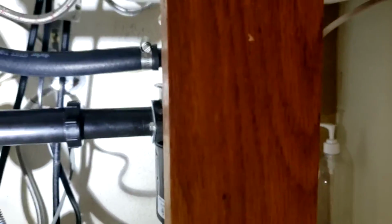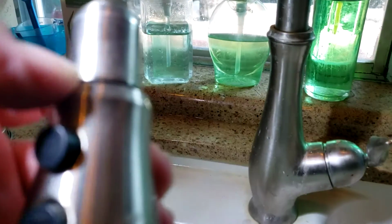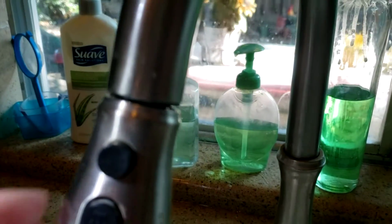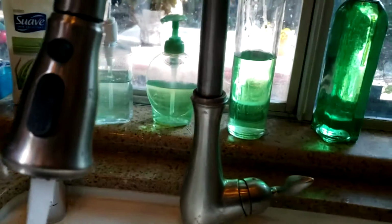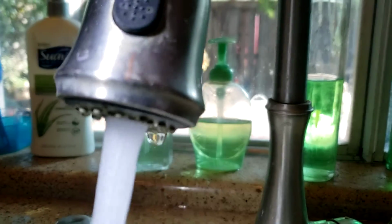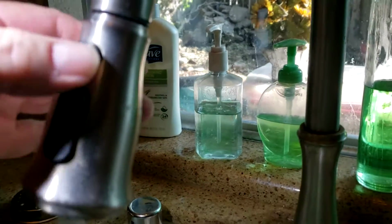So the other issue was the faucet was slow functioning, so we just pulled this hose out right here, disconnected the spray head, and cleaned out a little rubber gasket screen that's in here. So it flows pretty good. This thing doesn't really stay fitted real correctly, but right now I think that's infinitely better than what you had. A lot of that functionality still is the clogged head. You can take this and dip this entire head down here into distilled white vinegar and clean that out. But I think that's pretty good flow compared to what you have when we got here.